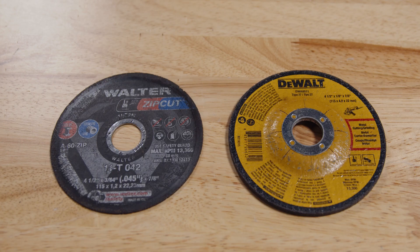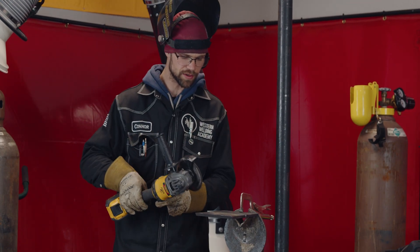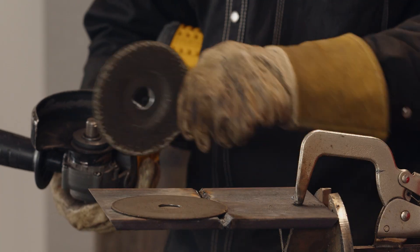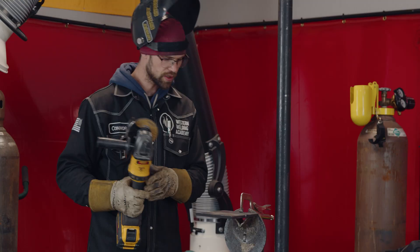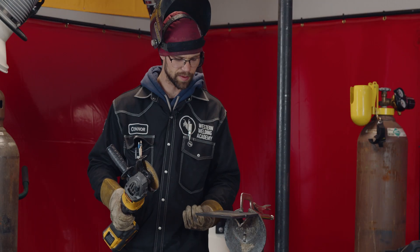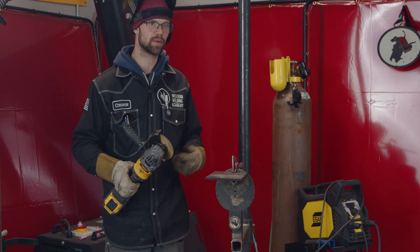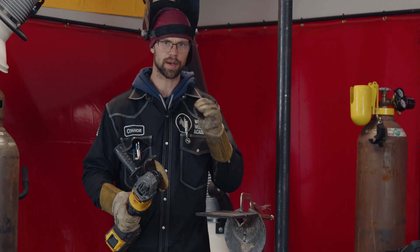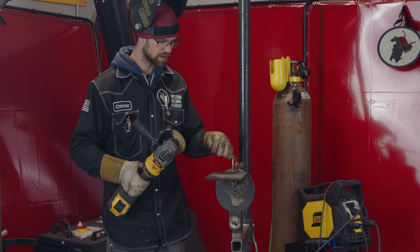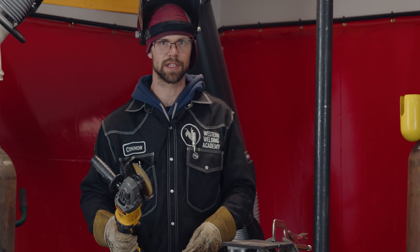To clean this, we're going to switch from the cutoff wheel to the eighth-inch wheel, because the cutoff wheel is too dangerous to work around in here. When I start grinding I'm going to be really careful not to go too thin. I have to keep in mind that I now have an eighth-inch gap, because when I cut it with the eighth-inch cutting wheel it left me an eighth-inch gap. So I'm going to want a pretty good size landing — I'm just going to clean up the edges of the bevel a little bit and be really conservative with my grinding.